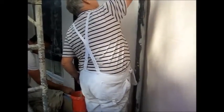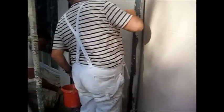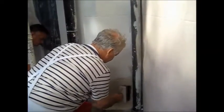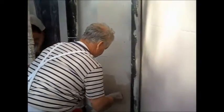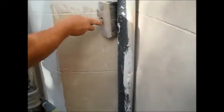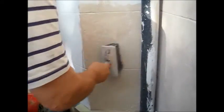One painter, Peter Watkin of Peter Watkin's Painters, Newtown, is starting in the lower corner and going to work upwards — just applying the paint, working it in in all directions. I'm finishing it with a sort of crosshatch light finish. You need to work it into all of the areas because you can't touch it up. You need to keep an eye on ashlar lines to make sure they don't run.